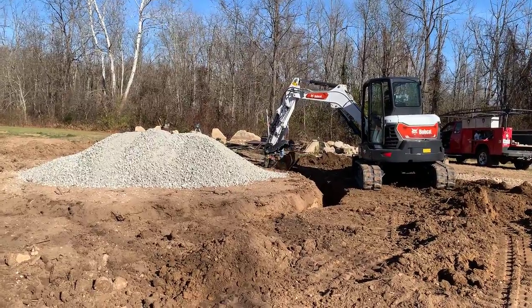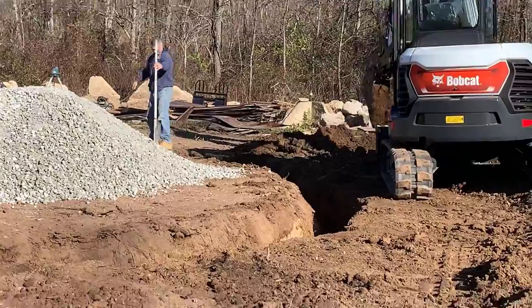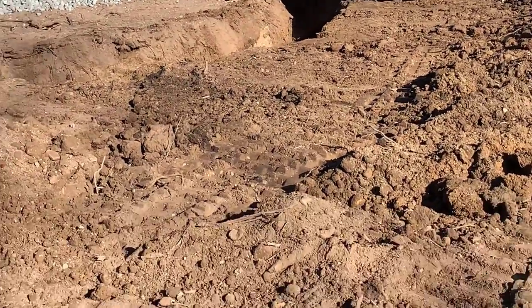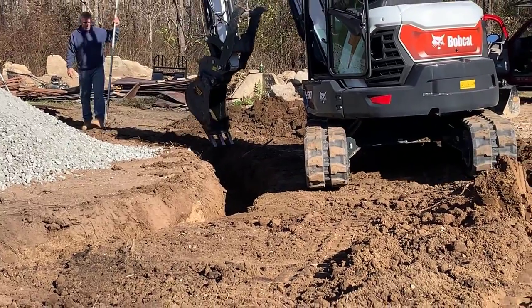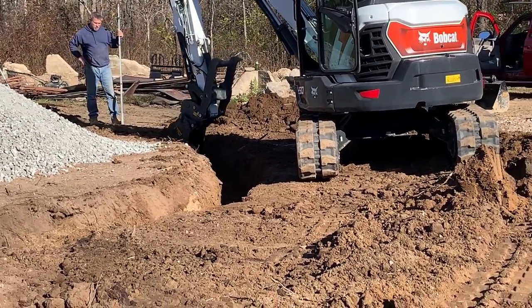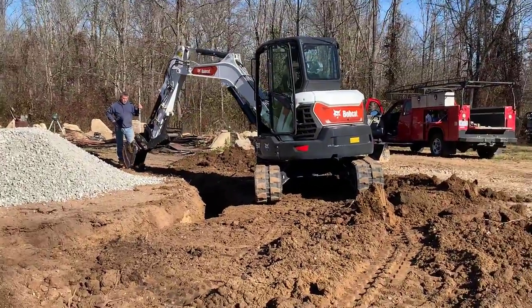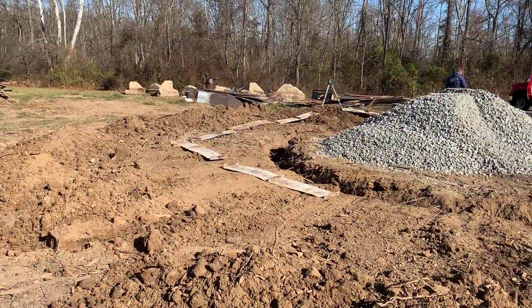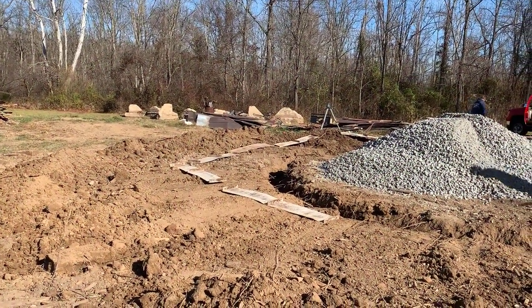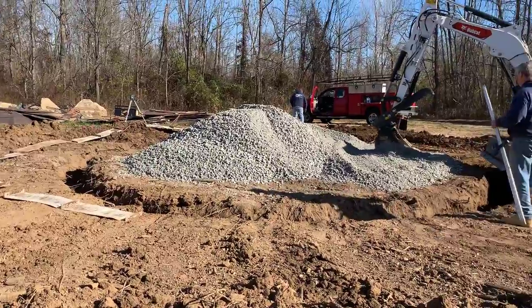What they're going to do is dig the circle out around the diameter of the grain bin pad and then put the forms around it. We have the concrete guys here and they're digging the circle for the grain bin. They're going to dig in for the foundation — we're going two feet down and then about 12 inches up. It's overkill, but that's what a grain bin looks like, and my husband really wanted it to be authentic. They're laying the forms around the edges and leveling out the gravel in the middle.